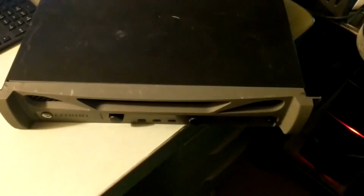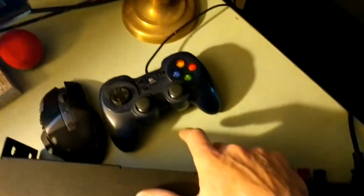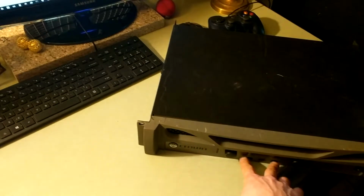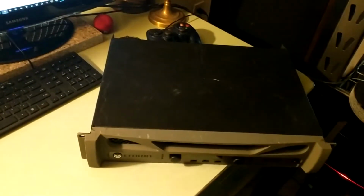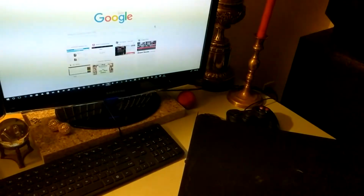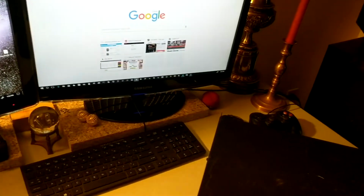And again, I've got the amp plugged in directly to the wall from the power supply. No cables connected. There are no jumpers or switches accessible on the back of the unit to adjust or play with. Everything's done. You're supposed to be able to turn this on and either connect via USB or use the front panel to adjust bridge, stereo, and whatever settings you want. Unfortunately, the way this powers up and then shuts itself off, you don't even really have a chance to access those settings. And when I do power it up connected with USB, it shuts itself off so quickly that the computer doesn't recognize it as a device. It just doesn't even have the time to do that.